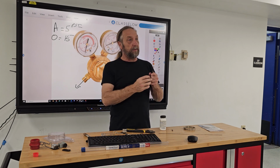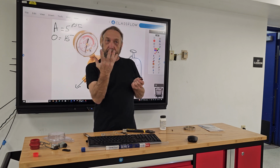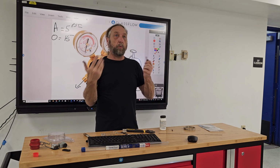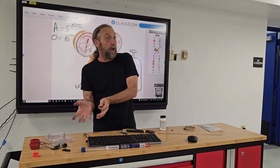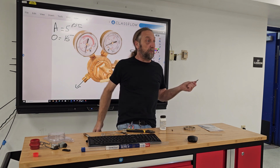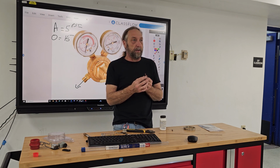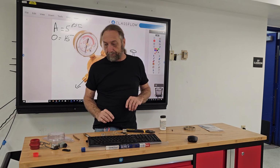Or they sand it and then they take their hand and wipe it to clean it. But like I said, if you touch the window, you've got oil. We don't want oil on our tubing when we're going to braze. We're going to cause leaks. So keep a nice clean rag. Hey, if you want to wipe it, take your shirt and do this if you really feel you have to rub it. Don't put your hands on it. Okay? So that's how we're going to do that.